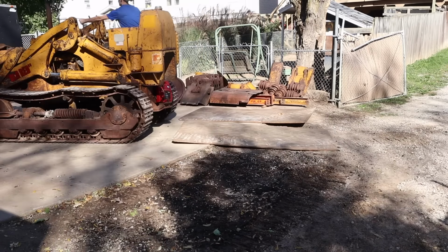And I don't know if that was just condensation that's a normal buildup in valve covers like this. Doesn't worry me too much because in here I don't see a lot of rust. And there might have been some condensation that had been sitting in here for a long time. Obviously, I didn't take this valve cover off when we were at the other building when we first got the machine running. But hopefully just flushing the oil and cleaning this out will be all it needs. Other than the head gasket, which is a whole other problem. So we'll deal with that when we get to it.